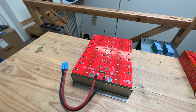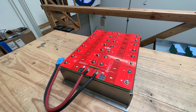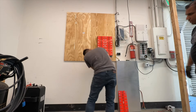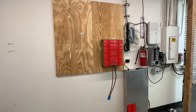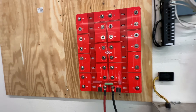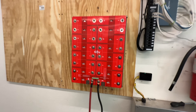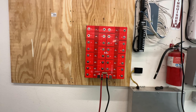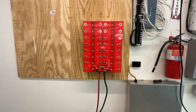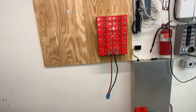And there is our 48-volt battery. This is 74 amp hours. This one's about 80 pounds. I would suggest you use help so that you can put it up in the wall, if that's what you're going to do. And that's pretty compact compared to all the other batteries that are wall mounted like this. But it's only 3.5 kilowatt because it's 74 amp hours by 48 volts. Of course you could always just put more and you can double your capacity that way.